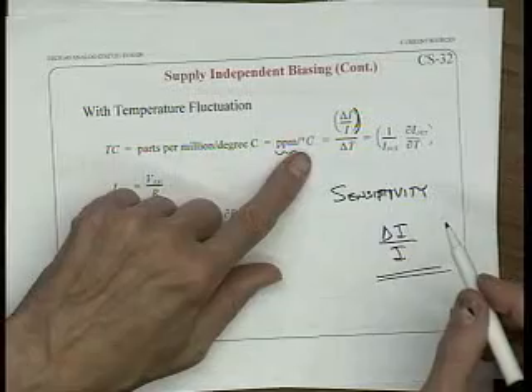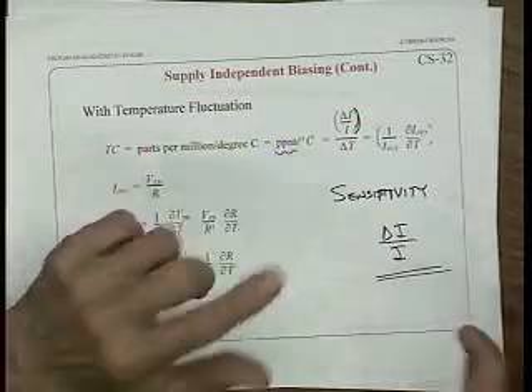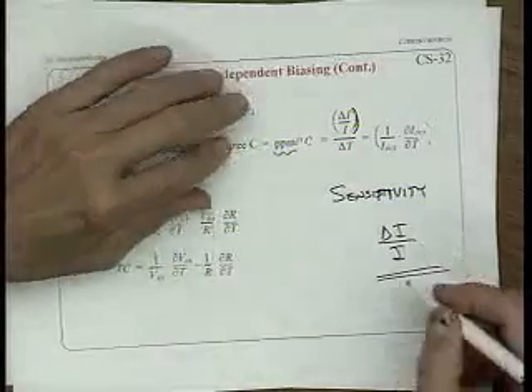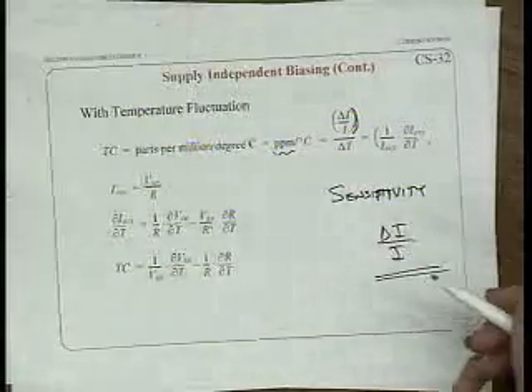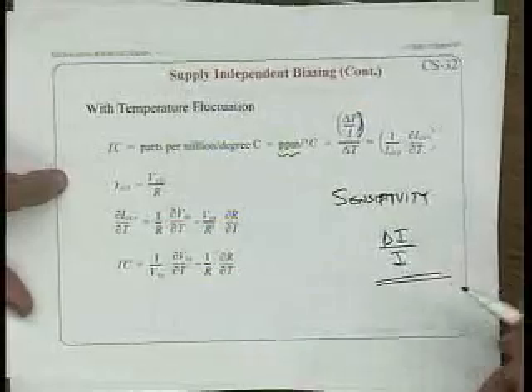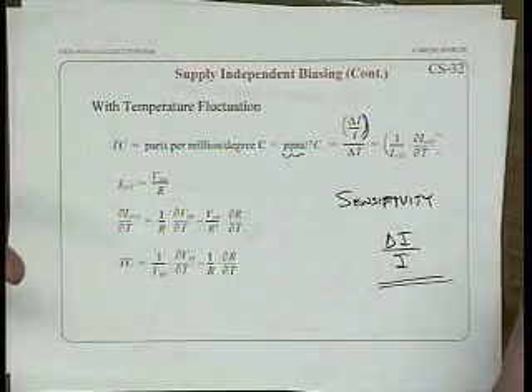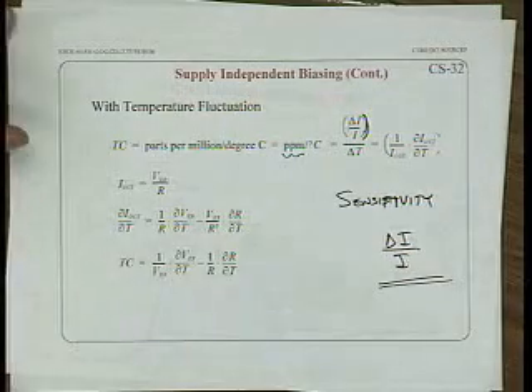You can do this with respect to temperature as well. If you're doing a real design, you need to characterize the sensitivity of your circuits to temperature. MOS transistors degrade as you go up in temperature — K' (mobility) kind of goes down, and V_threshold changes. As you go down in temperature, K' actually gets better — people talk about running circuits at 77 degrees Kelvin. Generally MOS gets better when you go lower and worse as you go up in temperature.